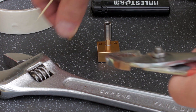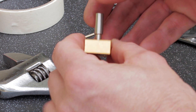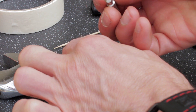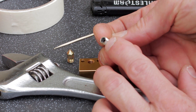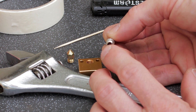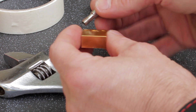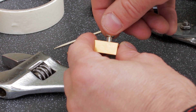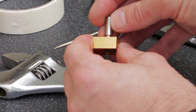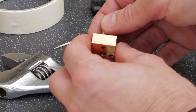What I'm going to do now before I reassemble this is do the same with this stainless tube, because I'd inserted it wrong and I've got some PLA inside this stainless tube here. So I'm going to heat this up and do the same thing with the toothpicks until I've cleared all that out. I'll need a little bit of thread lock on this — I noticed after taking it out that it's quite loose now, and it had thread lock on, so I need to put a dab of thread lock on before I put it back in.